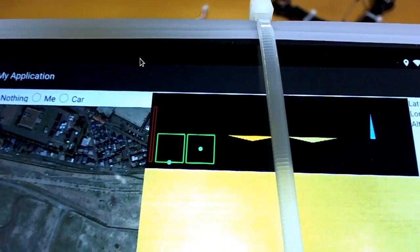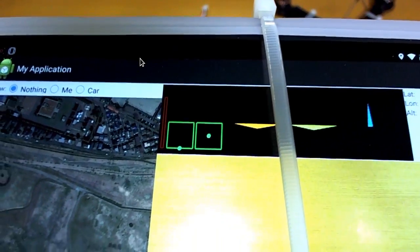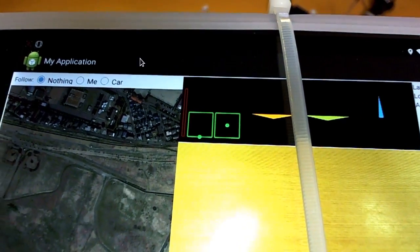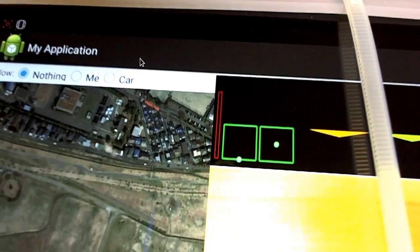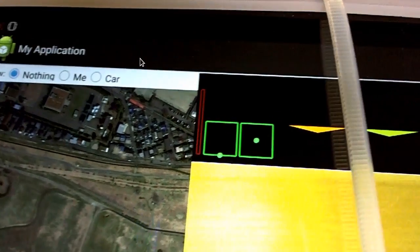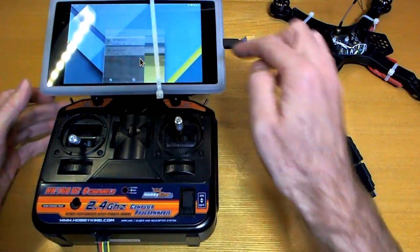No, sorry, starting from the left, it is the roll, the pitch and the heading of the quadcopter. And in the bottom left we have the positions of the sticks, and then to the left of that the red bar there is showing an indication of how many packets per second have been received, acknowledged rather. And let's see what that does when we connect it up.